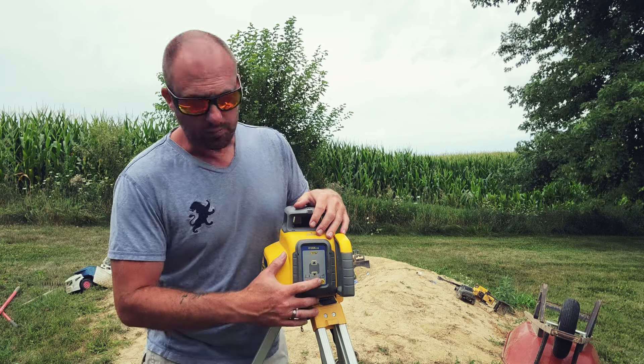I just remembered that I totally skipped over a critical aspect I needed to cover on the laser. When you have the laser sitting on that tripod and it is actively spinning, don't move the laser - don't pick it up and jostle it. When you move the laser, you want to turn it off, do your moving and jostling, then turn it back on and let it re-level itself. Whenever the laser is in automatic mode, you don't want to jostle it because you will screw up the gyroscope and the calibration. Make sure you power it off before you move the laser around the job site.